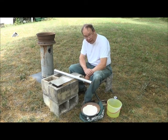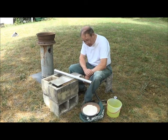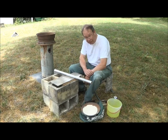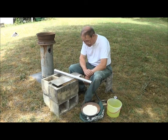But about the clay, not any old clay will make a good ceramic, but we do have 3 varieties of clays here in Washington County that when combined will. And these include kaolin, an expanding clay, commonly known as Fuller's Earth, as well as our regular, familiar, good old Georgia red clay and sand. And this can be used to make a ceramic mix that will not crack when fired, hopefully. At least that's the desired result.